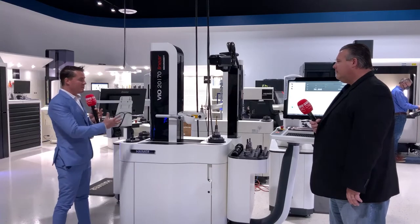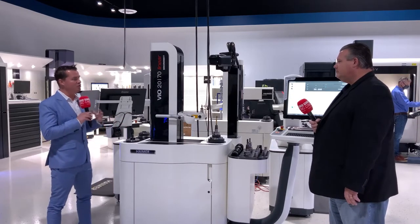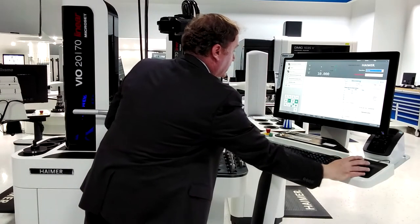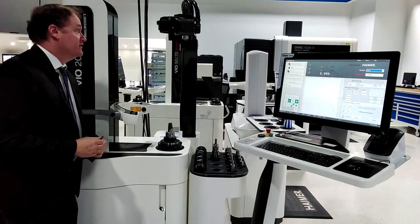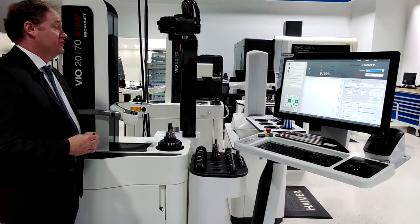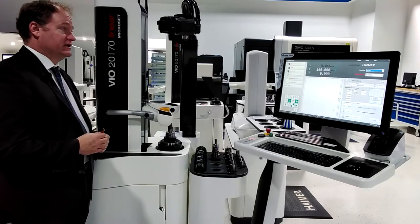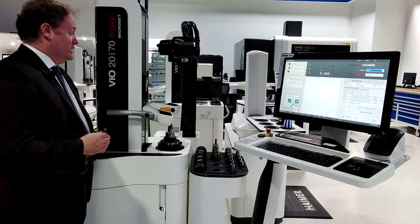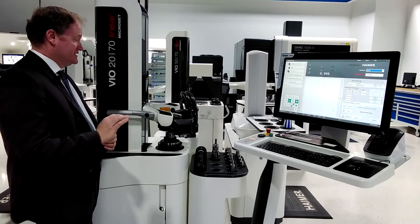With this dual system that's able to multitask, what industries have the most value for a machine like this? First, high-production automotive, especially when running multiple spindle machines — they need to set the z-axis consistently on all spindles, to plus or minus 5 microns. Aerospace manufacturers want to preset tools ahead of time, checking height, diameter, and runout, then export that information directly to the machine tool, print a label, or write to an RFID chip — all in one setup. Of all machines on the market that can do this type of work, we have the smallest, most compact design, taking up the least amount of space in a tool room.